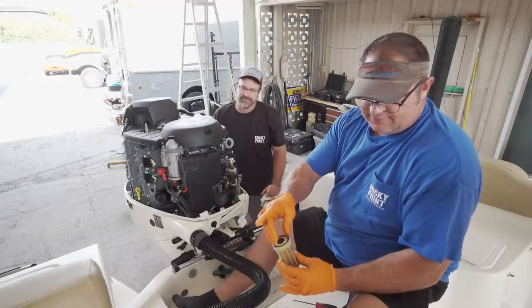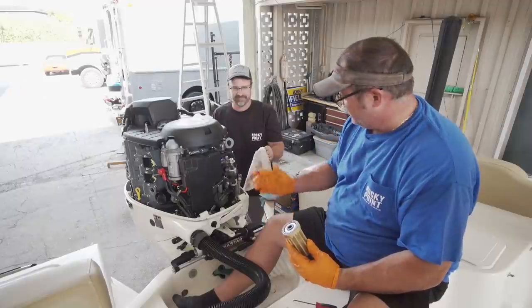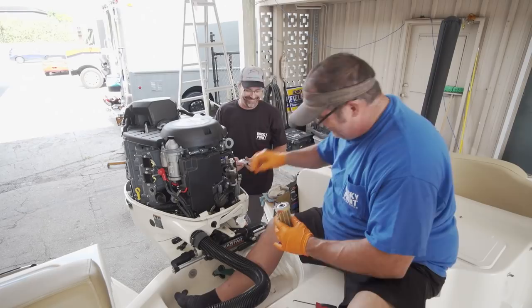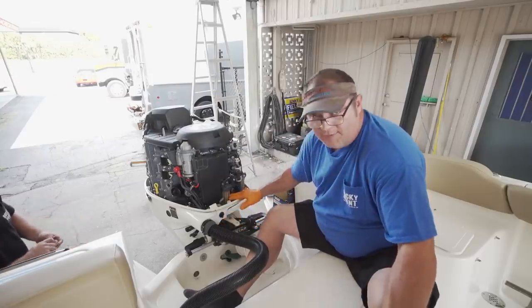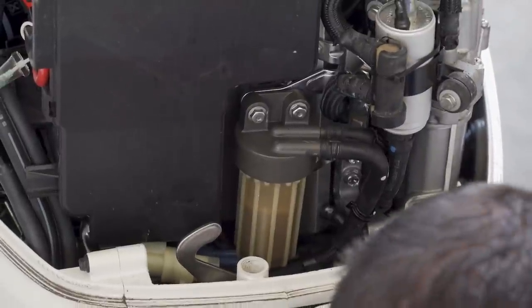Now we've got it clean. We have our new fuel filter and we're going to install it. I like to put a little grease on the threads so we don't have to fight it off and on every time. I also put a little on my O-ring to protect it. Now we're going to reinstall our fuel filter onto the block. The blue connector is actually for your water and fuel sensor, so we want to make sure we reconnect this. I'm going to find my primer bulb and prime the fuel system so I can check around here for leaks - we want to fix any leaks before we give this boat back to the client. It's firm now, I'm checking around the filter and there are no leaks.